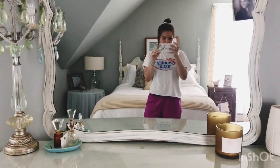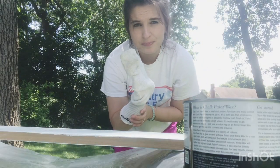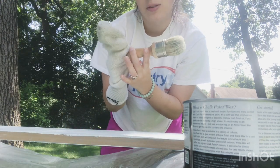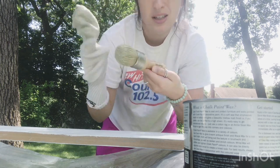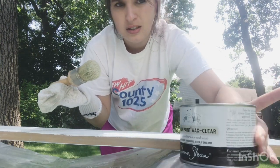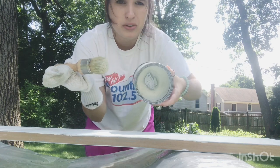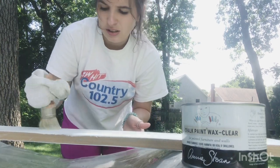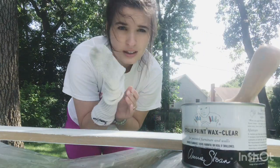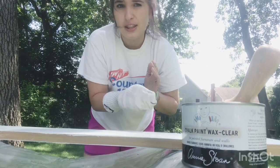I'm back and I just finished waxing. I used a wax sign brush and the chalk paint clear wax — you don't even need that much, we've done tons of projects with just one tin. You swirl it on in circular motions with the brush, and then just like my mom said, you take a sock and buff it out. I just did that on the whole shelf.